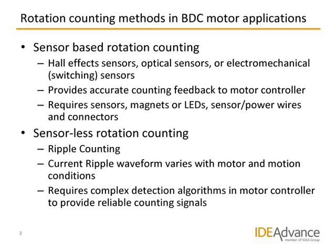The reliability problems are caused by the current ripple waveform being influenced by the actual supply voltage and load, speed, direction and temperature of the motor. The in-rush current when the motor starts, and whether the motor is powered or coasting in generator mode driven by the rotating mass, the aging of the motor parts and electromagnetic interference are other factors influencing the reliability.